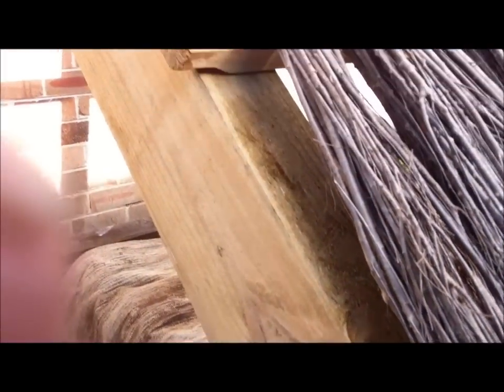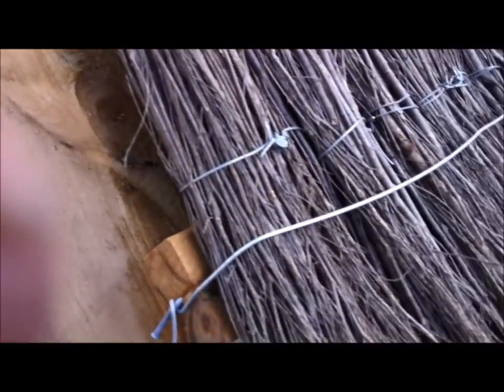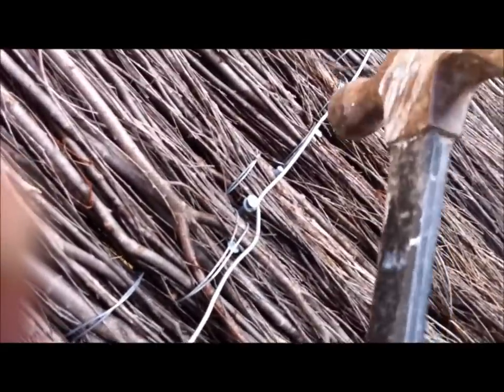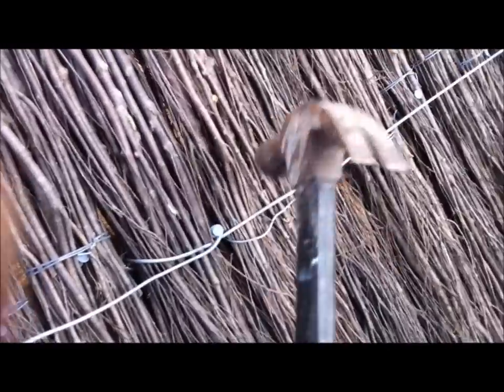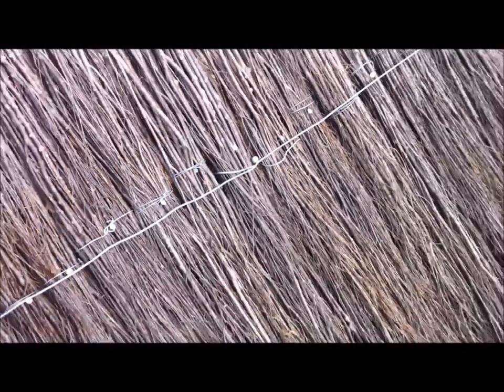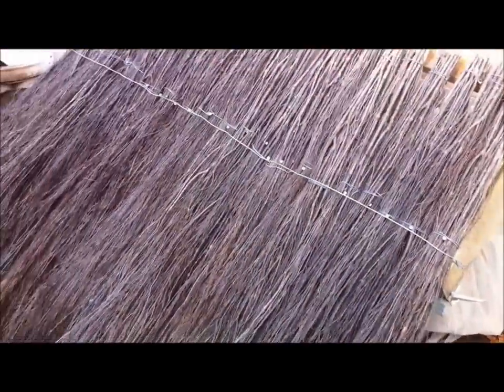This nail on the edge of the roof will be covered later with the capping after the thatch panels have been put on. Hammer in the nails to make the wire tight around the brush. There you have it — the first row done in about 10 minutes.